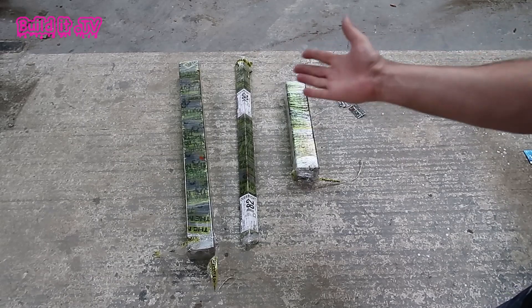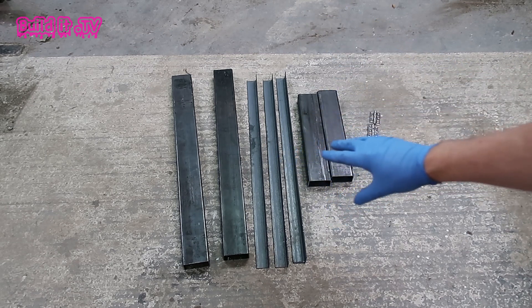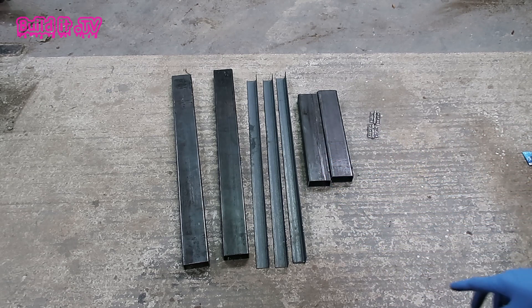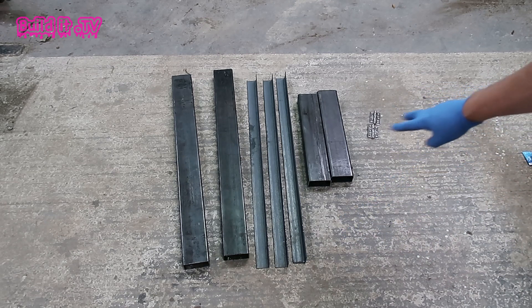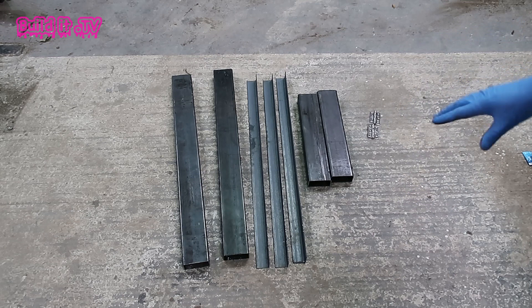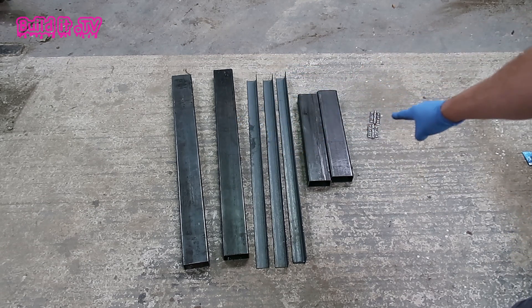Let's open this up and here we have it. The metal store does lengths in either one meter, three meter, or six meter, so I've gone for three meters of box section which is 100 mil by — I want to say 40, maybe 100 mil by 50 — and had them cut it so we've got two half-meter pieces for our feet and two meter lengths for our uprights. With the L section we've gone for three meters chopped into three one-meter lengths, and that's going to be our bending area. First thing to do is get our uprights mounted onto our feet.